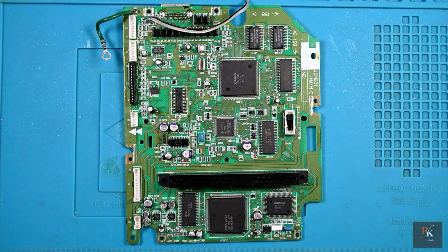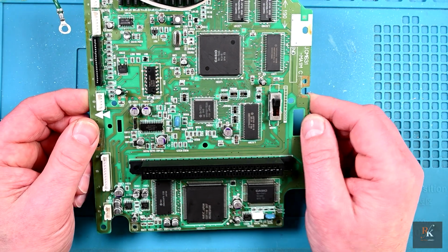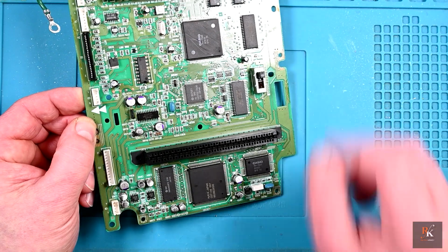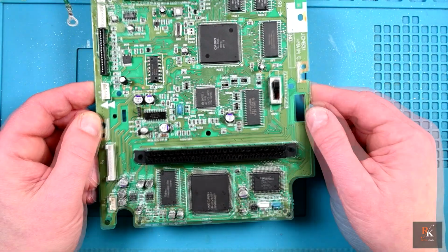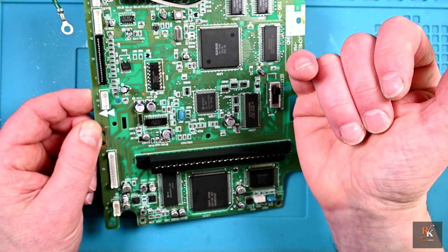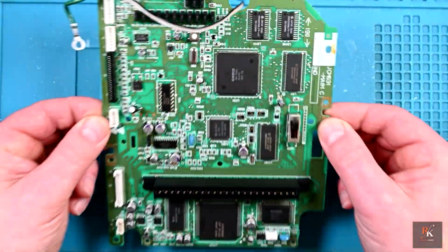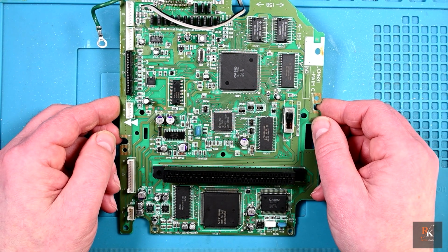And I'm done. It appears they're all down. The polarities are correct. I have been over under magnification. I've moved a couple of small solder balls, one of which was down here and it would have caused an issue because it was between 2 legs. But a very old solder ball that's still stuck on the original flux from manufacture. There's a lot of flux on this. Yeah, not great. Right. With that all done, let's pop it back together.